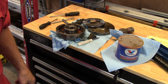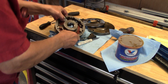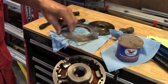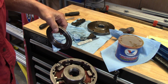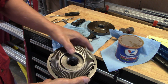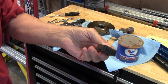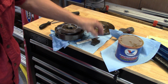So in the event somebody hasn't seen a chuck open, you've got this little guy right here machined to hold this little wedge, geared piece with a scroll. How's that? And the scroll will face the grooves like this. And in the grooves are these teeth that are shaped in a curve. And each one of these guys is numbered as to which place it goes in.